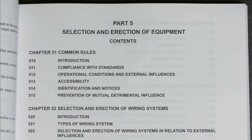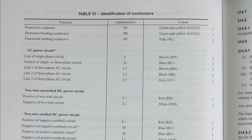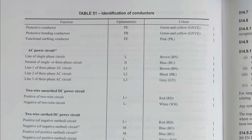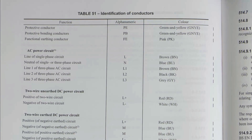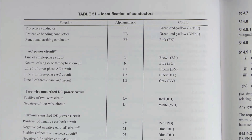Now as with the other parts of this, there are quite a few changes in capitalisation or just one or two words changed, so I'm not going to be bothering with those. The first main thing here is Table 51. Table 51 itself is not new, but the colours in it definitely are. See there the various types of circuits and the colours which are used for those particular means of identification.